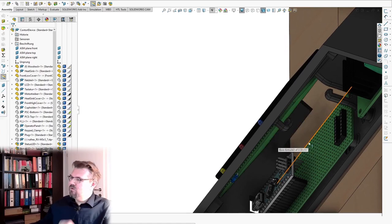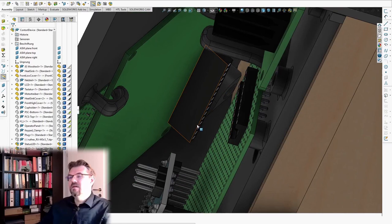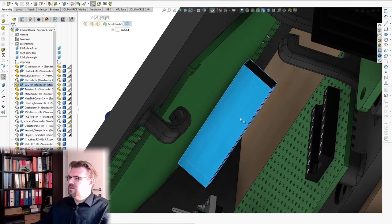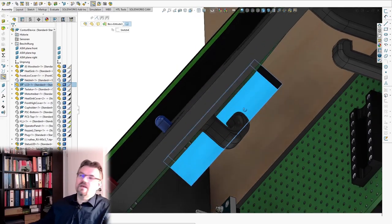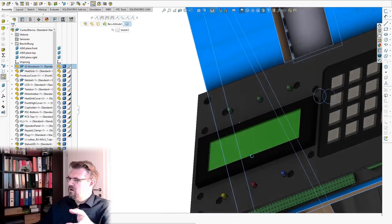The only thing I've not drawn in there was this adapter, the I2C adapter here, and this was a mistake because it simply did not fit in here. This was bad, actually. I then had to tweak this a little bit. I unsoldered this plug and directly soldered the I2C device. Then it fit, but I was lucky. So advice, whenever you're planning something like this, draw everything you can. Then it should work. All right.